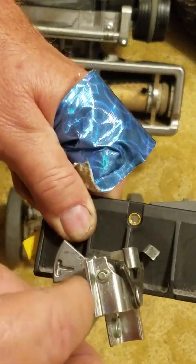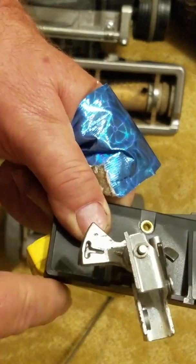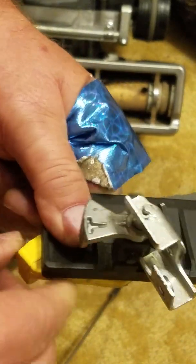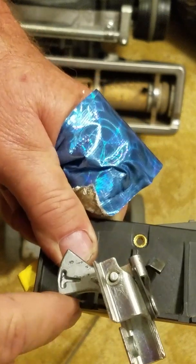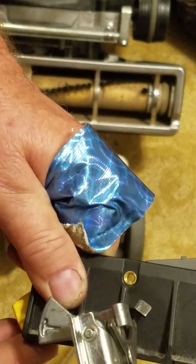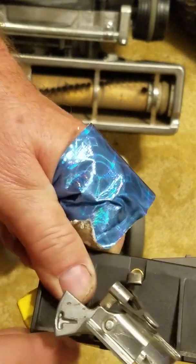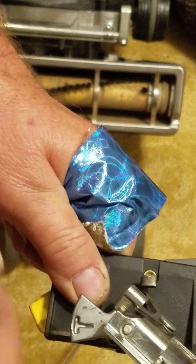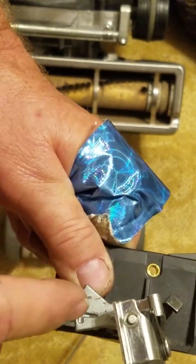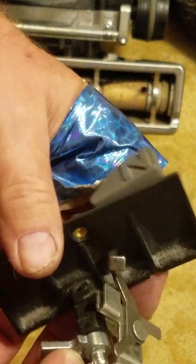So when you get that specific spline that's like this, with the drive button lined up on the bottom edge of the housing and the T lined up pointing, maybe not exactly, but real close to that same line. If you move it one tooth, it'll be off quite a bit. It'll be noticeably off. And then you tap that down.